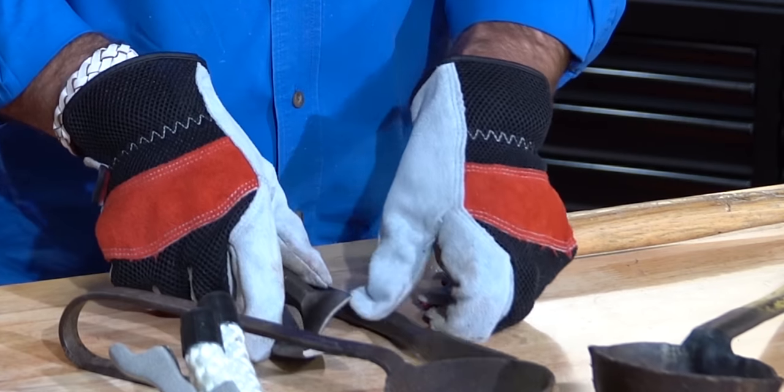So your yarning iron here, you've got a couple of ladles, but then you've literally got an outside iron which pushes the lead towards the inside, and you've got an inside iron, and then this one here is flat — this is my finish iron. I tap this around it just to try to make everything look good. So what I was taught is you pack your lead towards the inside, then you go to the inside and push everything down, then take your finishing iron and go around it. So I'm going to get everything ready over here — we're going to heat up some lead and we're going to pour a joint.